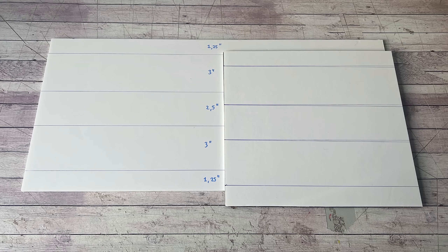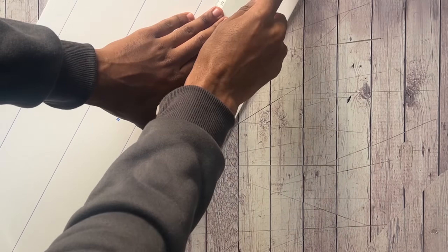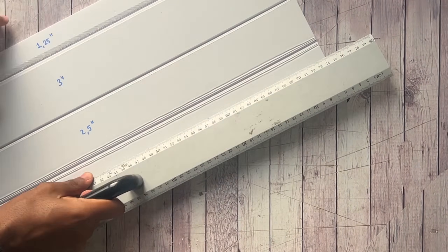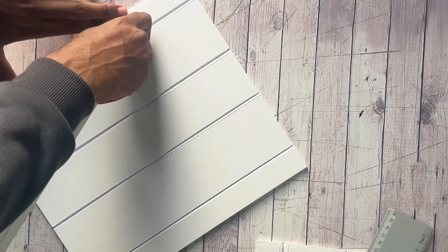Here you see two 5mm thick foam board sheets that are going to be constructed into the fuselage. The long piece is 57.5cm long and the short one has a length of 30cm. Both have dimensions of 3-inch height and 2.5-inch width. Here you can see me cutting halfway through the foam board using the Experimental Airlines techniques, and then using a ruler to fatigue the foam board by widening the halfway cut. At some corners I fatigue it even more to simplify the folds into the square shape. It's so easy to fold the corners that I just do it with my hands.